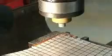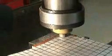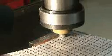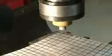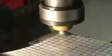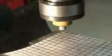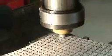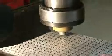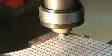For the first row that I burnish, I'm going to line up the stick even with 2 edges of each grid, but kind of in the center, not on the line, and work my way across like that. For the next line, I'm going to go on the line, but even with this bottom edge right here, and then work over to the next one and the next one. And then for the subsequent lines, I just alternate back and forth, first going inside the square for a row, and then on the line, like so.